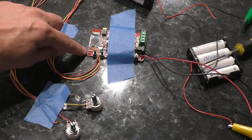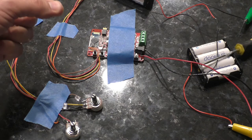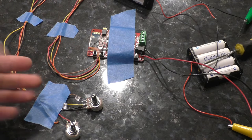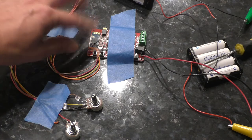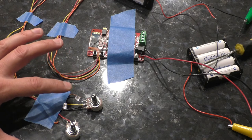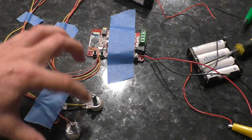Well, the LEDs on this board are teeny tiny surface mount LEDs, which I destroyed getting off, so there's no chance of just moving those. And I wasn't 100% certain if the teeny tiny resistors on here were going to be enough to handle the current of these larger LEDs. I think they're all the same, but I'm not 100% certain, so I ran them through a couple of potentiometers